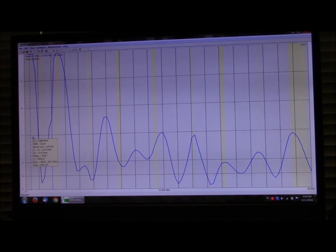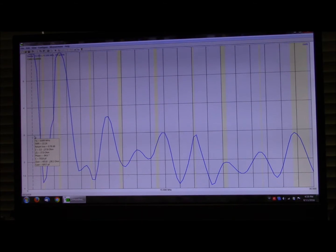Hello, this is Brett from Survival Comms. This is a very quick video about an antenna I threw together. It's an end-fed. I used a 9-to-1 Un-Un, and 120 feet of WD-1A wire as a radiator, and a 60-foot counterpoise that's just thrown along the ground.